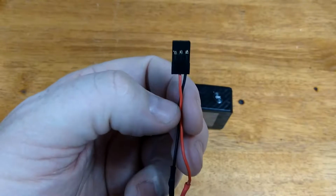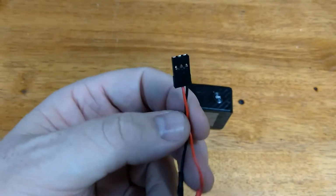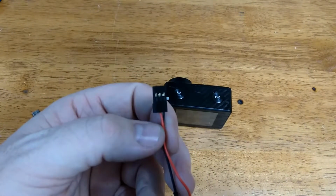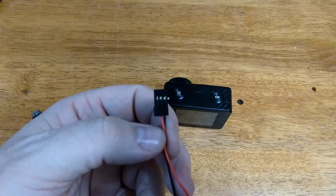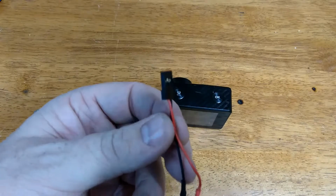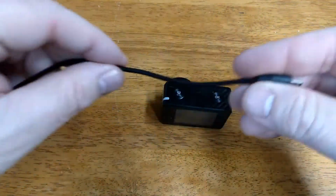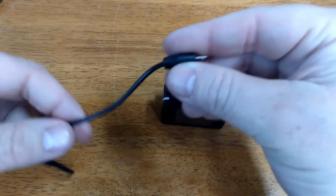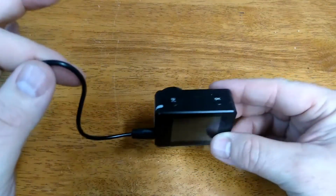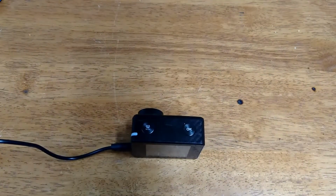If you have a toy grade, let's say you have like a Bugs 3 or something like that, you can actually open it up and look around on your circuitry there and try to find an output that's between 3.8 volts and 5 volts. You can solder these wires directly to it. You can actually make yourself a hole, put this wire into it prior to soldering to the right length, and then you can come right out of the drone straight into the camera and power it that way.